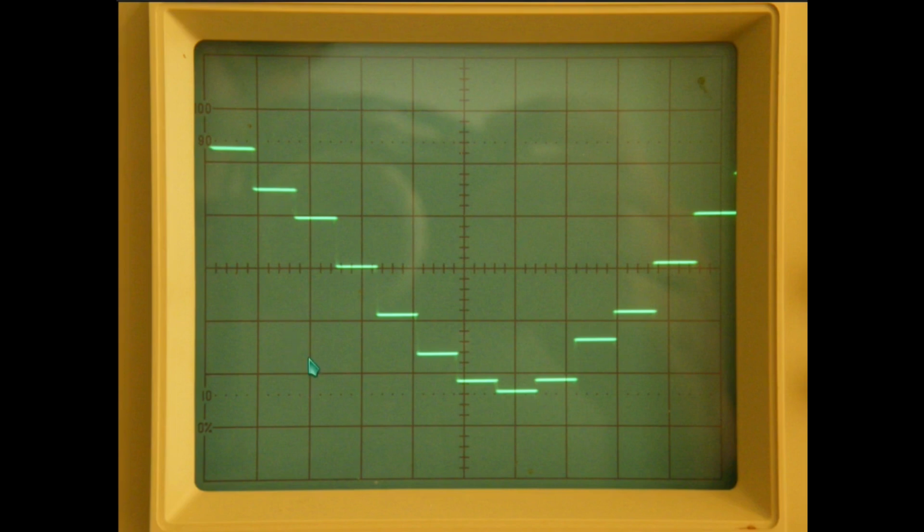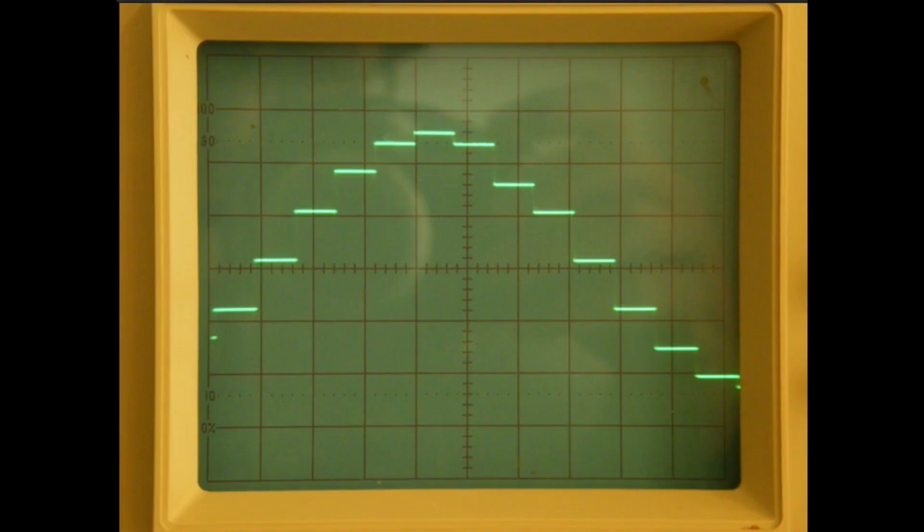The point at which I synchronize is this point here, that you can't see the edge, it's a negative going edge, but it's the positive version of this point here, which is the far negative, and that's got a positive edge. Well, this up here is a negative edge, and this synchronization is sent into channel 2, and you don't actually get to see this anymore. It's just used as a reference pulse. Such are the vagaries of analog scoping.